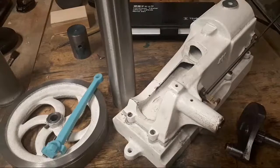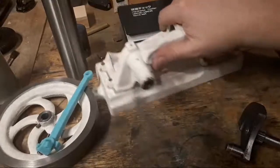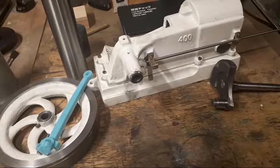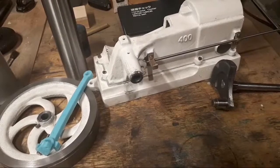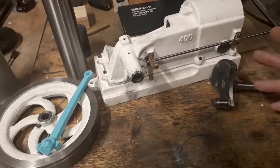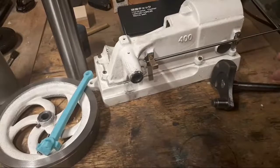There's a lot of reading through plans. I got asked about an undertype engine today. Someone looking for a big stationary horizontal fire tube boiler engine, and back in the early years of the century through to about 1930, there were quite a few good English designs for undertype engines. Undertype engine being a locomotive boiler with the engine with the cylinders under the smoke box and the crank back under the boiler.